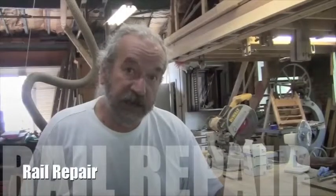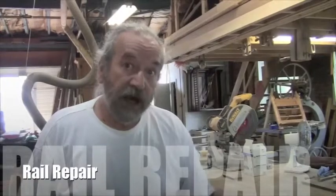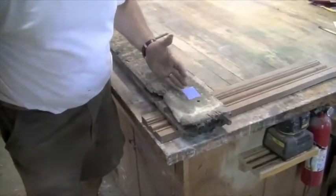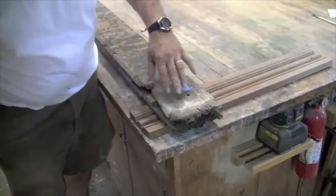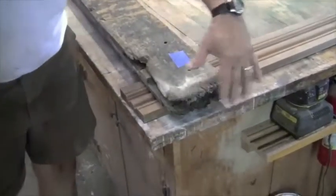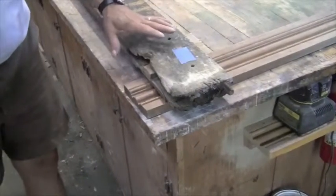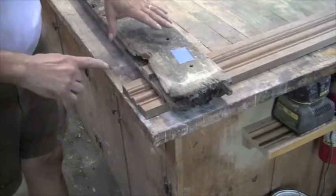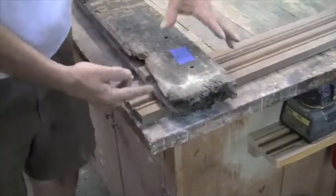It's opened and cleaned so that I can test that mortise, and so that when I glue this thing together, it's going to be the right size and shape, and the tenons will fit into it. Cull good, straight pieces of wood, and then fit new pieces into the trimmed openings, and then glue and clamp them together and set it aside for another time.